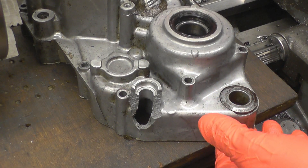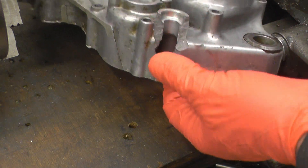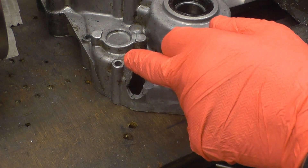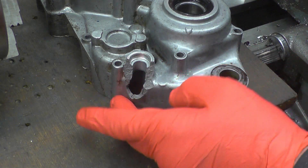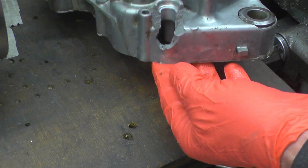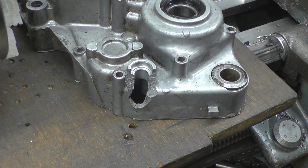This motorbike casing came in — a two-stroke bike casing. I'm not sure what sort of bike it's off. It's probably where a gear change or something goes in there. As you can see the casing is smashed off — you won't be able to weld that back together and he hasn't got the missing bit anyway. So what I'll do is make a steel pin that fits in there, the same shape as that, and lay molten aluminium up against it, knock the pin out, and that'll give a good representation of the other half. This bit here is cracked — I'll smash that out and build it up with aluminium weld. You've got to do a fair bit of damage before you start to make sure you get all the other crap out of the metal. We'll make a pin for it first and go from there.